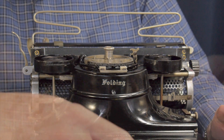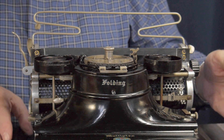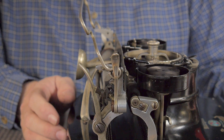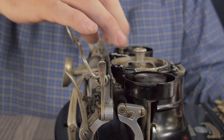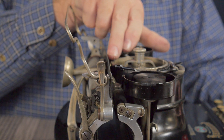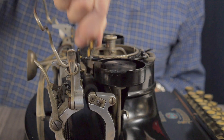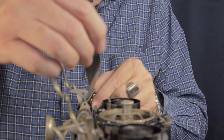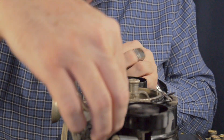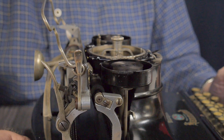First we want to show some of the things you're going to have to get to use the Hammond typewriter — ribbon, of course. This typewriter has a constant pressure. So when you type, no matter how hard you type, this hammer is going to hit the anvil through this rubber impression strip through a little slot in what's called the ribbon guide, the ribbon and the paper. No matter how hard you press the key, it's going to hit the paper at the same pressure all the time. The impression strip is just a simple piece of rubber with a couple of grommets on each end that fit into these pins. That does the function of a platen that we would know in a regular typewriter, but there's really almost nothing normal about this machine.